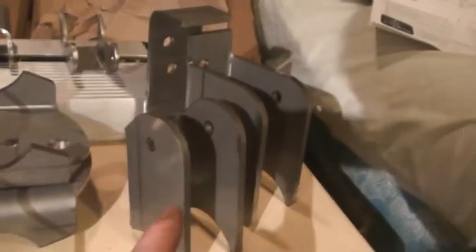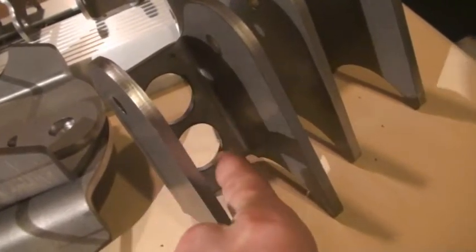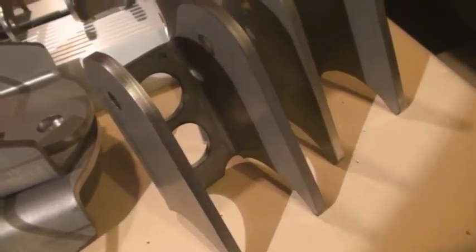These are the bolts I'm going to be replacing with grade 8 bolts — not necessary really, but I'm going to do it. These two here, this one and this one, are the upper control arm mounts. I'm still not too sure what these two giant holes are for on this side. This here is for the track bar — it just gets welded to this.